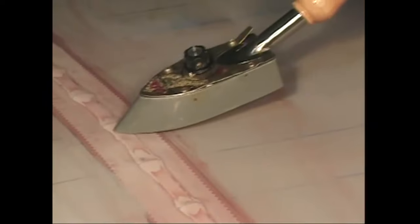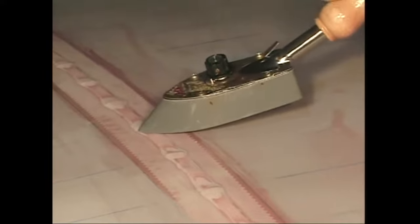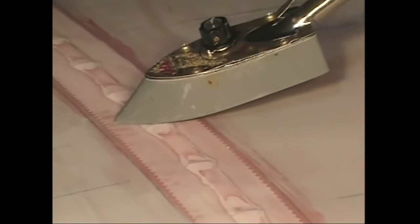If you do this properly, you will have very little sanding to do later. Take your time. To heat smooth this wing carefully would take the better part of a day. Using the little iron set at about 225 degrees, iron every single pinked edge of every single tape.